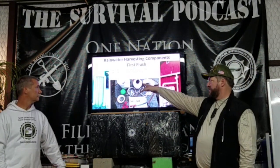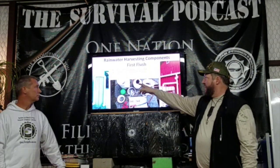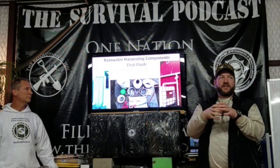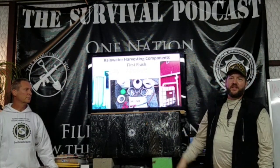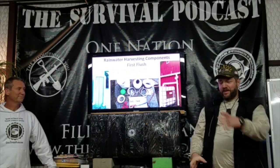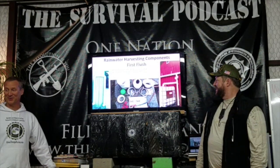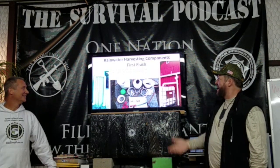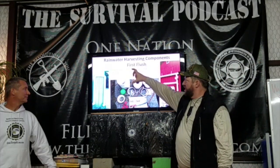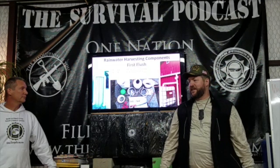So then in the tee, I've got a similar idea, but it's just a big enough water bottle. I bring it down from the 4-inch to the 3-inch, and that's enough of a neck down that the water bottle floats up into there and just stops it up. In the same method, but it's a Gatorade bottle I bought at Home Depot. I'm like, that's about the right size. So all in all, that was a little cheaper than my $35 solution. But the piping was still, I guess, you had to buy the pipe too. Yeah. And then it just goes up, and there's a little more headspace there. It flows up and over, and I just matched everything together and made it fit as best as possible.